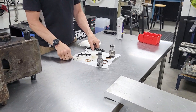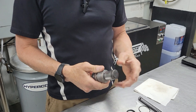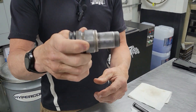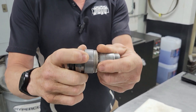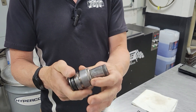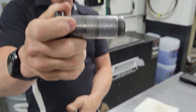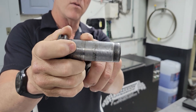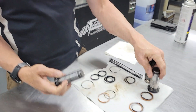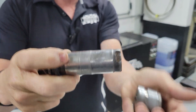You can come over here and take a look. You will want to, whether you know it or not, replace all these parts. Some people would just try and replace the seals here, but your problem is the bucket actually swivels right on these pistons. This is called the piston, and this is a bearing or a seal head. Your bucket's actually riding on this thing and taking all the force. It gets visibly worn down — you can see this thing is no longer the proper height it was when new. This thing is just grooved out and ground down, and that one is much, much worse.